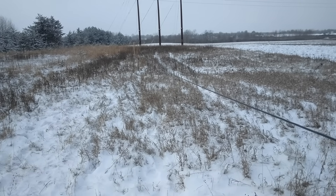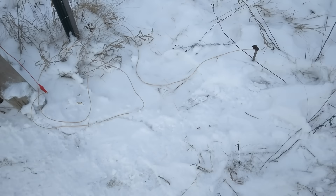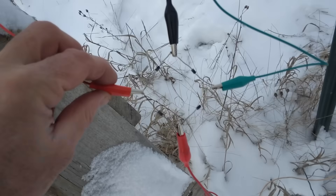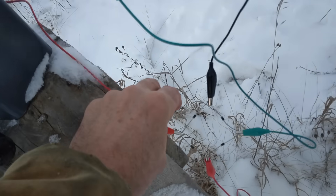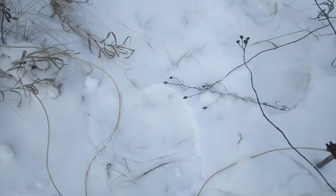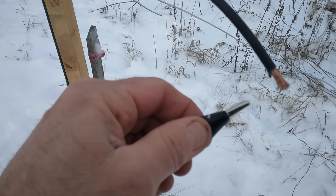What I'm going to do is connect one end to a capacitor and the other end to the ground, to charge up that high voltage capacitor. It's going to go through a bridge rectifier — these are some 1,000 volt diodes, a full bridge rectifier. The other end is just going to go to the ground that I set up in the other video. I just need to move my lead over to the bare wire.